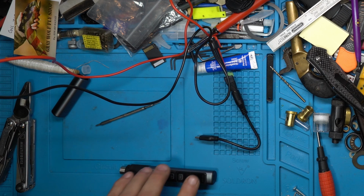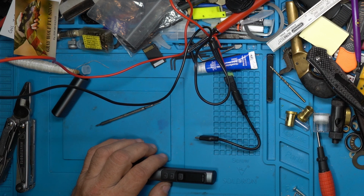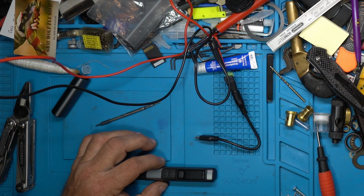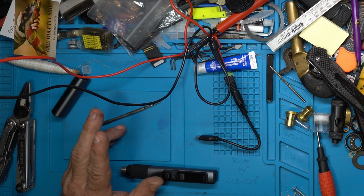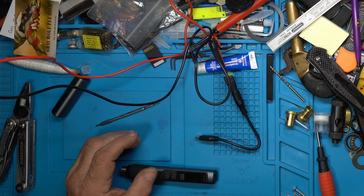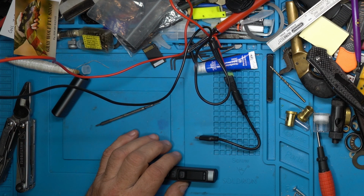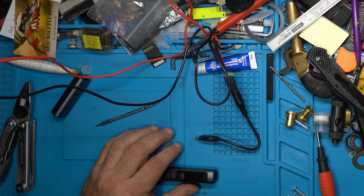I watched adaptive power run while plugged into my Rigol bench power supply, and I could see what it was doing because it shows me the amperage readings and everything as it comes up. What I saw it doing, between the two channels, was hitting anywhere from a very low wattage up to about 40 watts at a time. It seemed to be pulsing the power supply every so often and hitting it with amperage. The highest between the two channels in parallel that I saw was less than 3 amps, probably about 2.25, 2.5 amps.